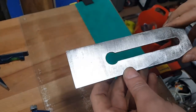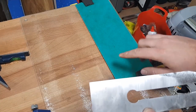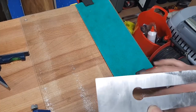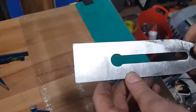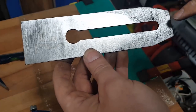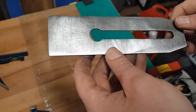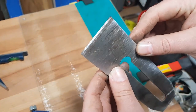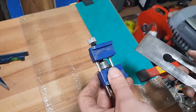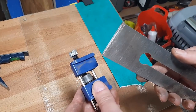I've gone through a lot of sandpaper to get to this level but I think I'm pretty happy now. I've switched from sandpaper sheets to a roll, which is much better quality than the type of stuff you get from cheaper stores. There's still a bit of pitting but given what we went through with the chip breaker I think that was expected. The next step is to clean up the cutting edge — I'm going to place it in my honing guide and run it across the sandpaper to get it back to a usable position before taking it to the sharpening stone.